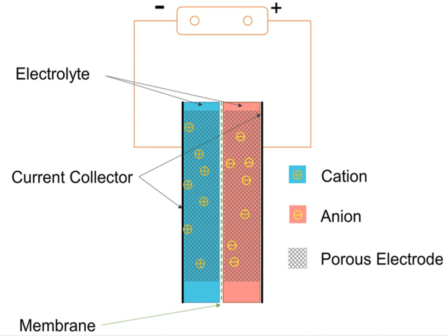With regards to rechargeable batteries, supercapacitors feature higher peak currents, low cost per cycle, no danger of overcharging, good reversibility, non-corrosive electrolyte and low material toxicity, while batteries offer lower purchase cost and stable voltage under discharge, but they require complex electronic control and switching equipment, with consequent energy loss and spark hazard given a short.